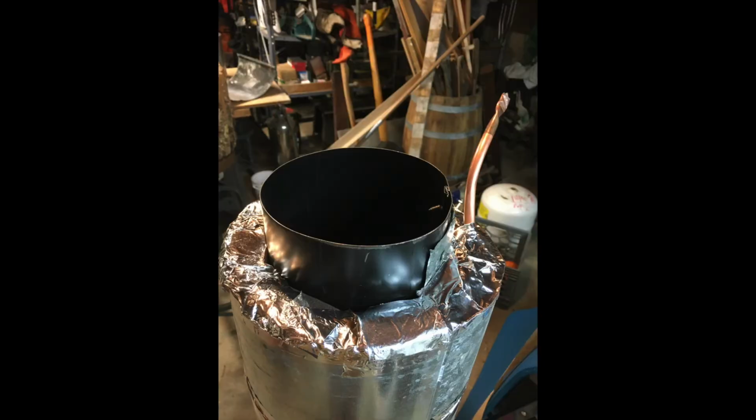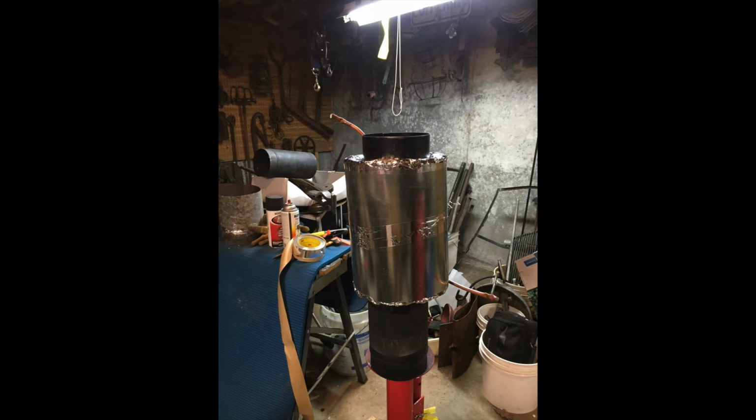So in this picture, you see the final product. That exterior around the preheater itself is stovepipe. I just stretched it out or opened it up as much as I could, then connected it where I could with that metal tape. You can get that metal tape in Harbor Freight or an HVAC store. The top and bottom I secured with the HVAC tape as well.